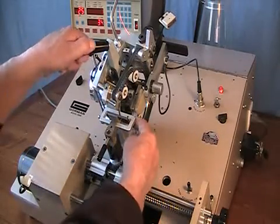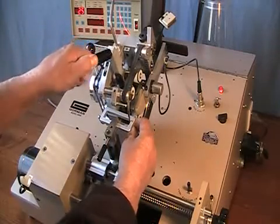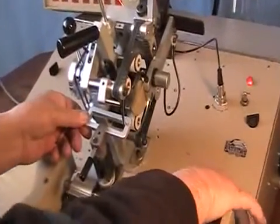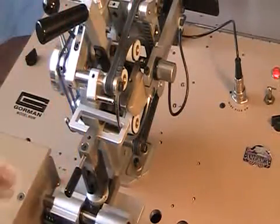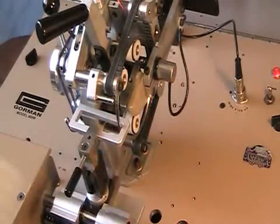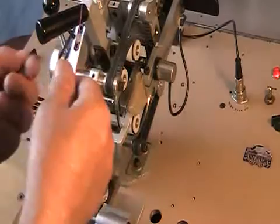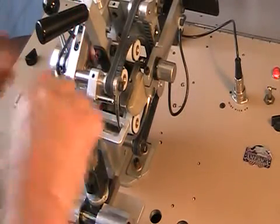The Barbator is our newest winding machine. It is actually a modified 900M toroid winding machine, which was designed for winding toroidal coils such as the one you see. We utilized the traverse mechanism from our Starwinder bobbin winder and mounted it with the standard core rotator assembly mounts.